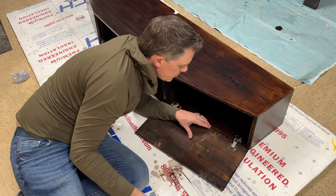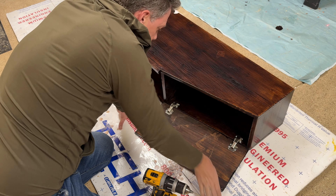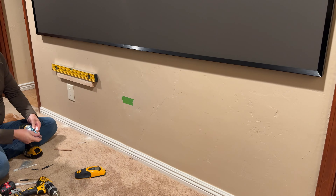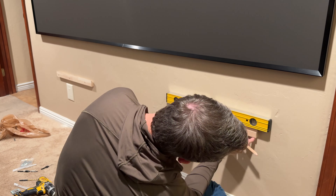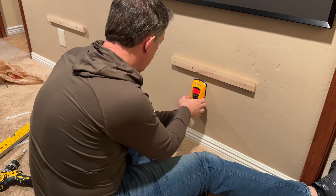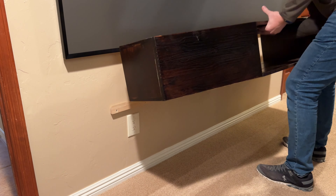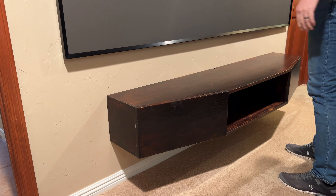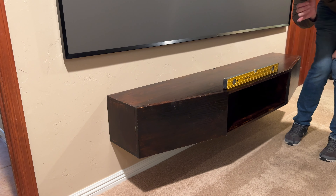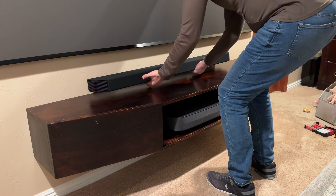Here I'm putting on really cool hinges that let the doors sit flush when closed and snap into place without needing extra anchoring. Here I'm securing the other half of the French cleats to two studs on the wall, measuring carefully to give myself wiggle room on either side. I made sure I knew where the studs were so everything was solid. After vacuuming the construction debris, I mounted the cabinet to the wall, checked that it was properly level on all sides, and secured it with cabinet screws directly into the studs.